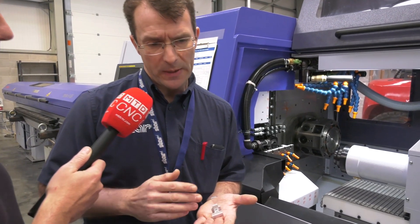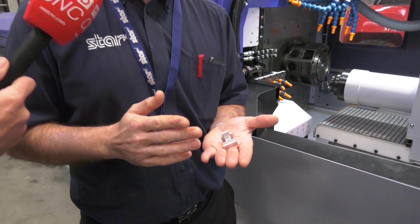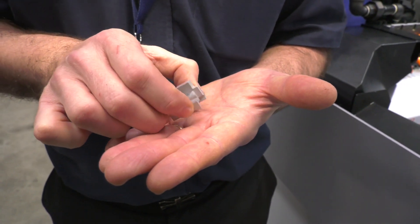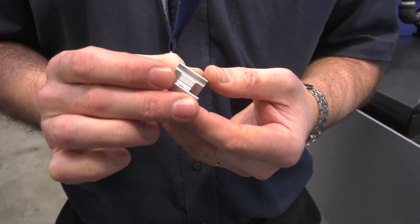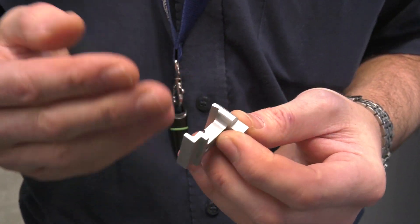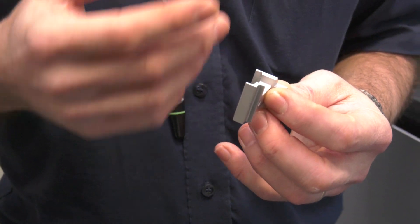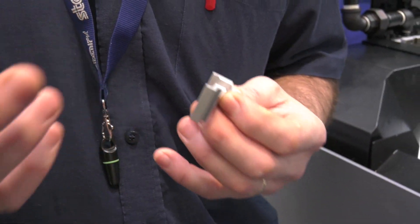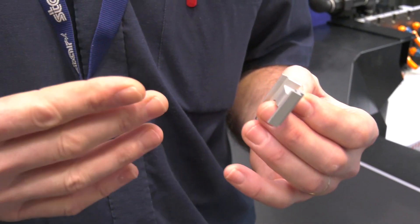The particular way we're going to manufacture this part, it's got to come out of a certain diameter material — 30mm stock. We're going to make this mainly on head one, but because we can balance mill and finish two faces at the same time, that's going to save us a lot of time. The customer looked at other combinations — twin spindle, twin turret — but on our machines, because of the idle time reductions, we got the order.